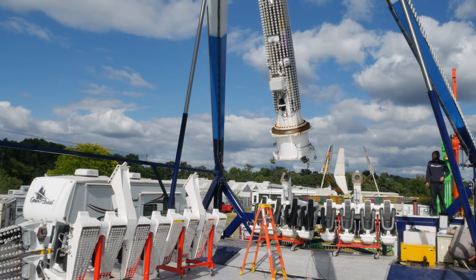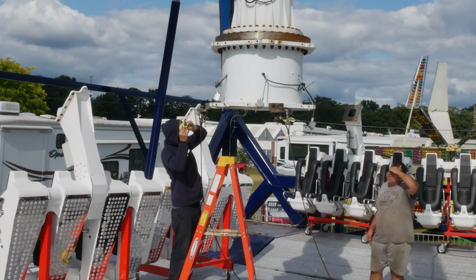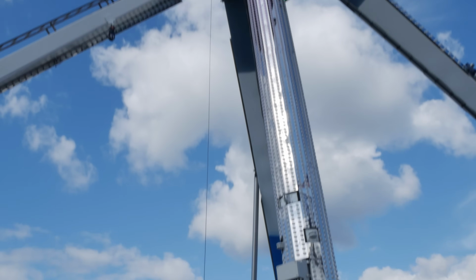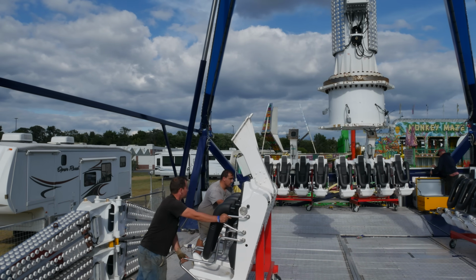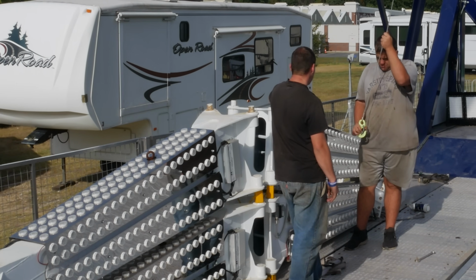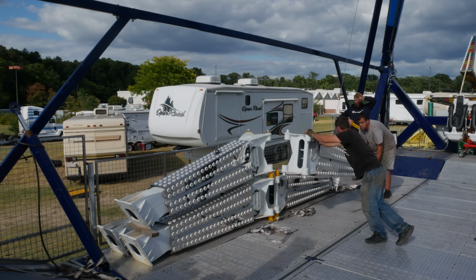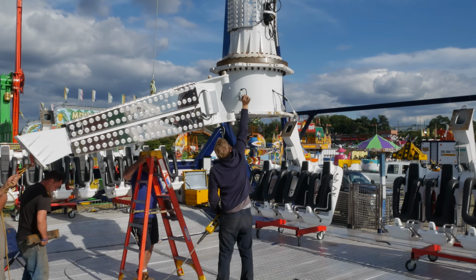Have you kept track of how many different jobs this winch has done so far? The winch is once again repositioned, this time through the snatch blocks that were installed before the tower was raised. In this configuration, the winch can be used to pick up the stub arms or swing arm sweeps and moved into position.